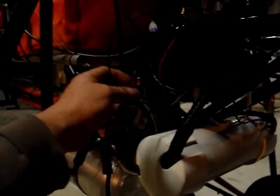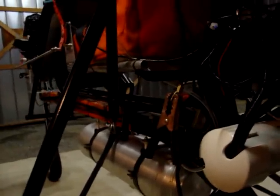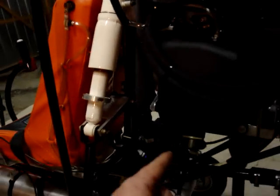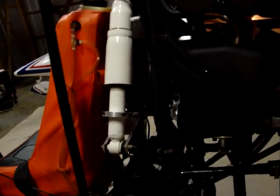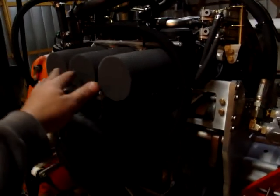I have a few wires up here that are kind of hanging loose — these are just ground wires that need to go to the battery. I think one is for the Hobbs meter on the panel and another is a ground wire for the electric trim. I still need to run a ground from the battery to the engine for starting, and right now I'm just using a set of jumper cables on the ground wire going over to the engine. I've got my air filters here — they still need to be oiled.